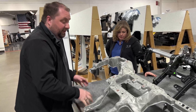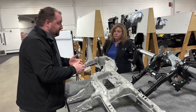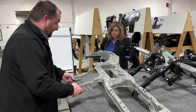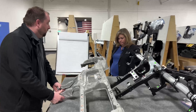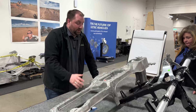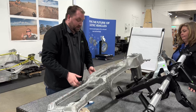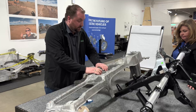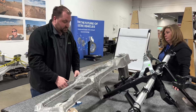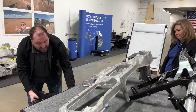Think about all those metal stampings on a stamped cross car beam — each one is going to be blanked, punched, and stamped into shape, but then you have all these raw sharp edges, so sometimes they have to be coined. There's a lot of processing and a lot of welding. Then they went to a style like this — a cast magnesium beam. When this came out it seemed like it was going to be the next great thing. Magnesium is incredibly light but also incredibly strong for its weight. With the stamped steel beam, wherever you wanted an attachment you had to add an arm or a tab with another weldment. With cast mag, you could include a lot of those features all into one casting, and everyone was switching over.